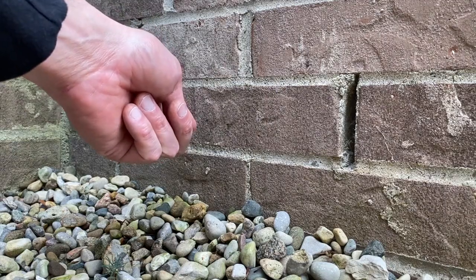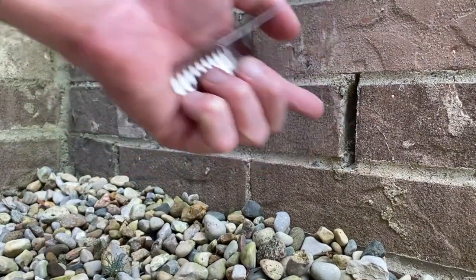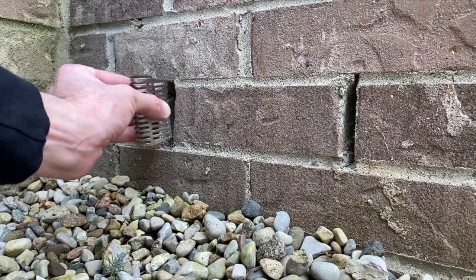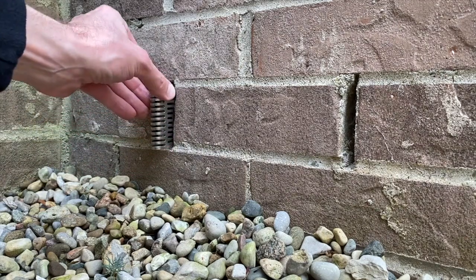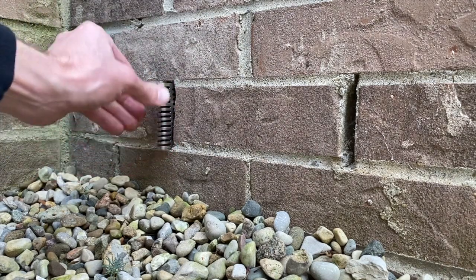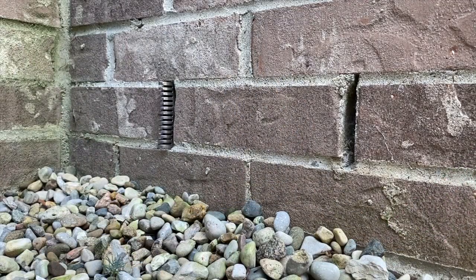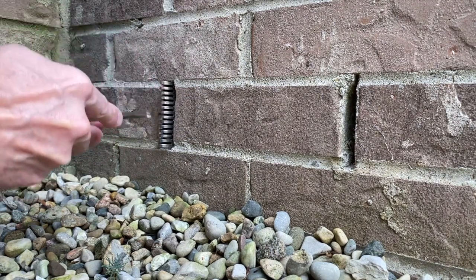In position now, I've got a larger weep hole and a smaller weep hole. I wanted to show you the difference in how to install these little screens when dealing with a larger versus a smaller weep hole. All you have to do is basically compress the screen as you see here. As you compress it, you can shift it into the hole. What I'm doing now is coming up top, compressing the top, pushing in, coming to the bottom, compressing, maybe the middle — and I just work it back and forth. It will get to a point where it becomes very difficult to compress by hand. From there, you can grab two flathead screwdrivers or needle nose pliers. In our case, we're going to use two flathead screwdrivers and push in, using our thumb to push it in as shown here.